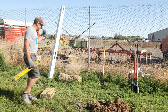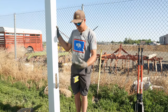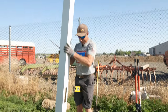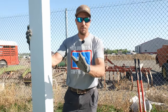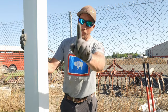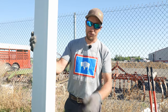We've got to set a post. We have our posts now and you have to figure out which end goes into the concrete — this end goes in, that's our top. There's no post that goes up inside this one, so if you're wondering where that inner post is, it doesn't have to be there. But if you hang a gate it has to be there, or if you're using cheap vinyl from a big box store you're going to want that post. We didn't get this vinyl from there, so we're good.